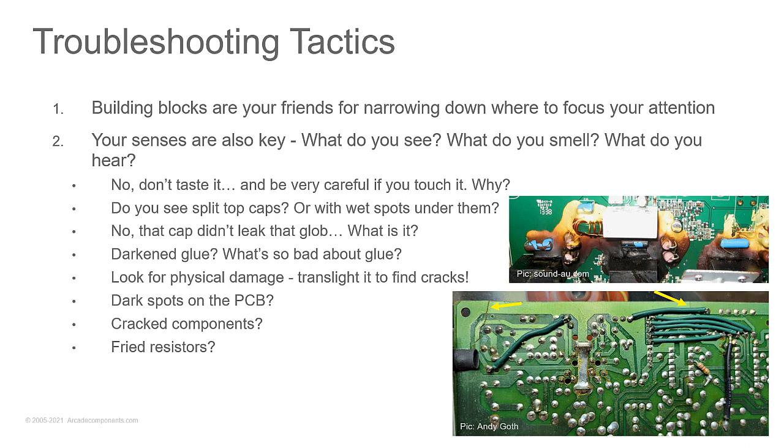It shows that it got exposed to some kind of heat. Well, the heat is an indicator typically of why it got dark. But what's the problem when the glue turns dark? Can't see through it. That's not it. Somebody popped it up in chat. It becomes conductive. And so the darker it gets, the more conductive it gets.